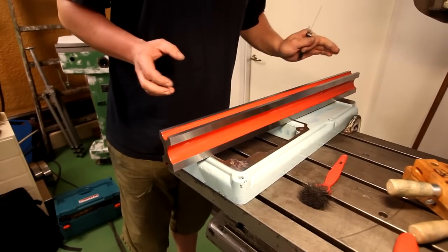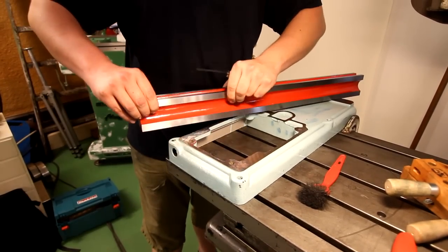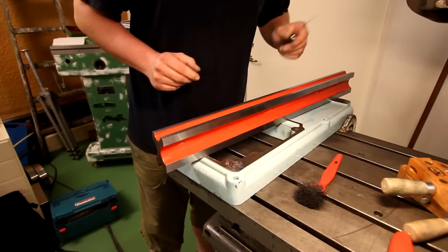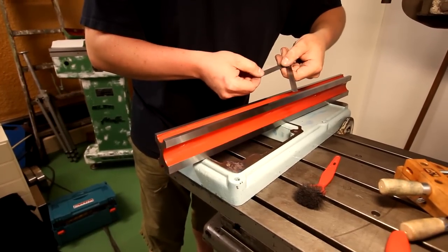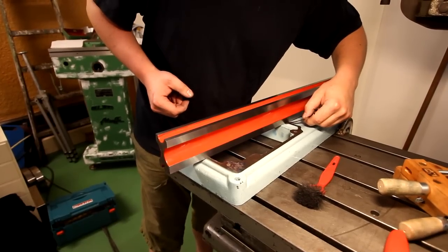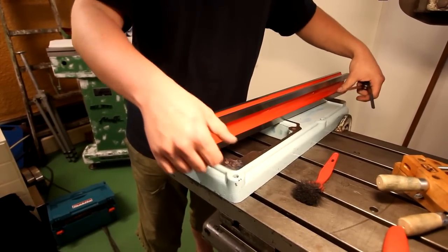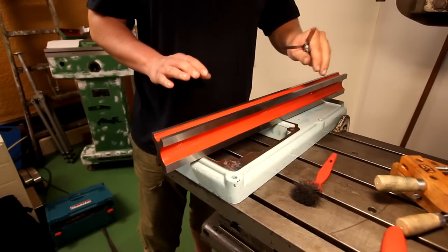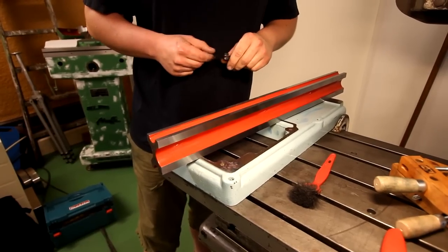Besides marking up on the surface plate and getting indications where it's touching, you can use a straight edge and feeler gauges. In this case it's 25 thousandths, and you can still get under here. So there's quite a bit to go on these pads. And you have to, as Richard says, start at the foundation and build upwards, just like building a house.